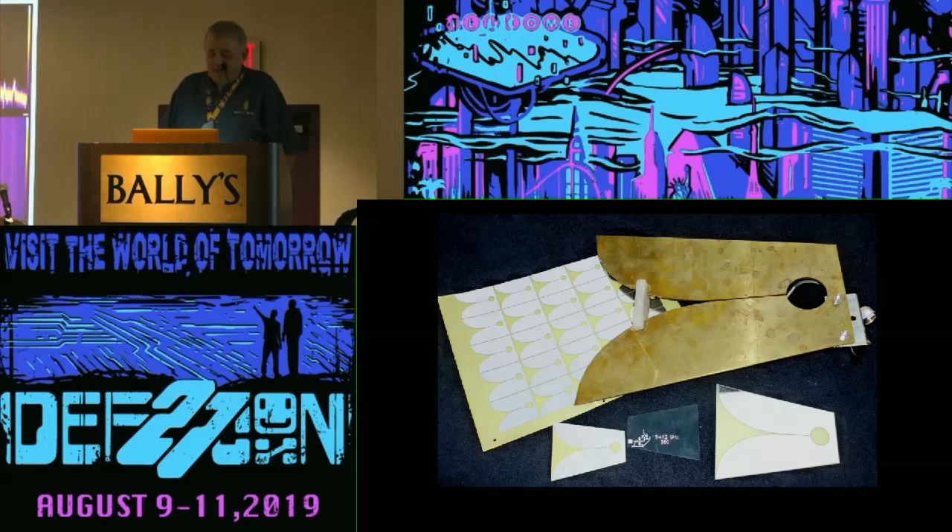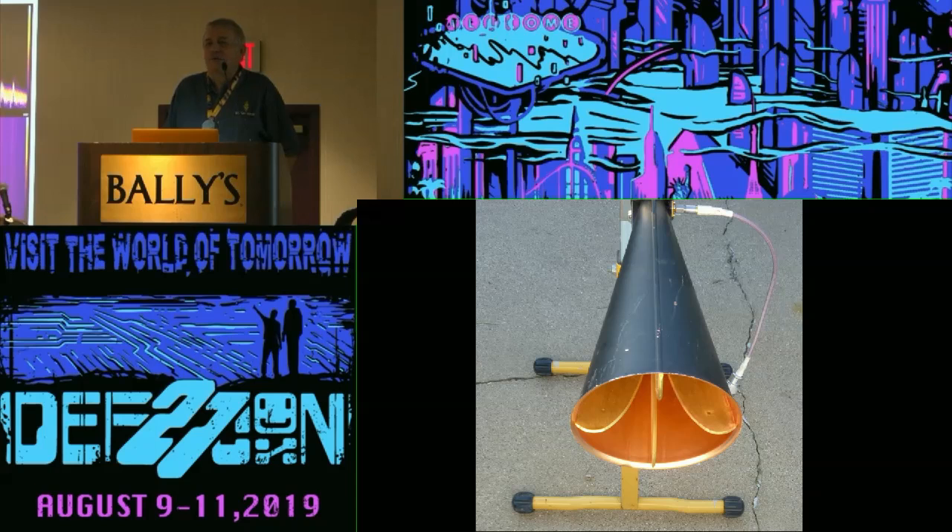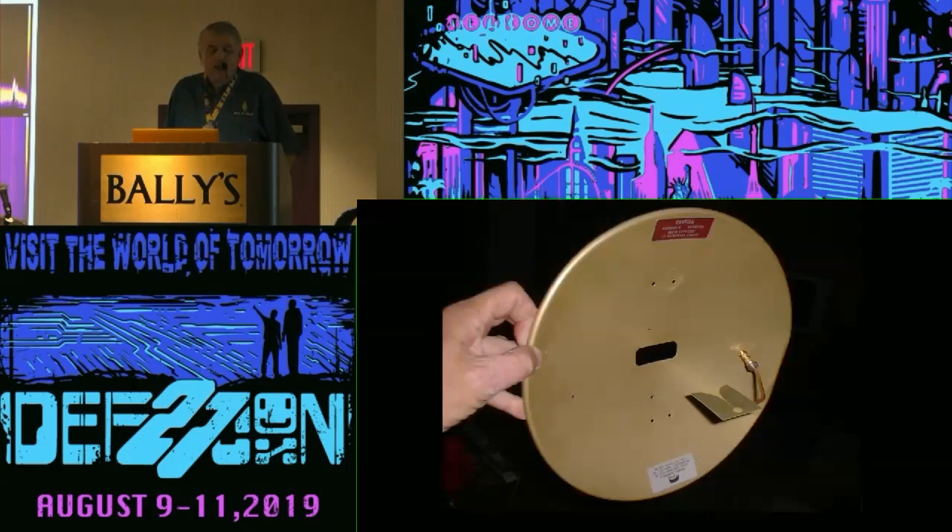Another extremely broadband antenna: the Vivaldi. There have been some interesting arguments as to whether it was designed in Italy or by an English engineer who just liked Vivaldi the composer. The lowest frequency is determined by the width of the opening; the highest frequency is determined by how fine you can make that gap. These antennas run around 6 to 8 dB gain and easily operate over 10 to 1 frequency ranges. The big brass one is currently being mounted at the focus of a dish on some P-3 Orion ELINT aircraft. I like to think of Vivaldis as a ridged horn without the horn, and they make cute little dish feeds.